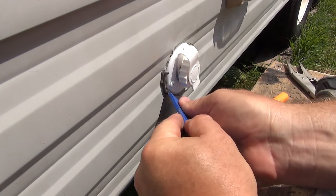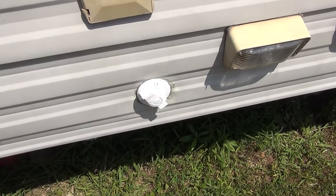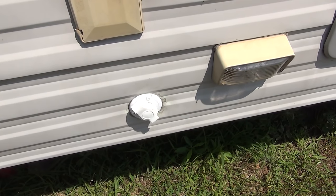Go ahead and put that back in place. Hopefully that lasts longer than the last one did. Trim off the excess. There it is — the final product. I've now replaced my inlet valve. It took longer than I expected but it got done. A couple of little tricks I didn't realize: make sure you pay attention to how yours is mounted and the size of the pipe thread needed. The link is down below — it's pretty common and covers quite a few. Find out what it'll take to access the thread, but it should be set up like mine where once the pump is loose, you can pull it out and do all the work outside. Thanks for watching and I hope to see you out there!